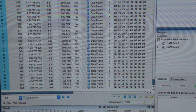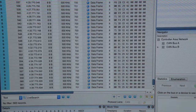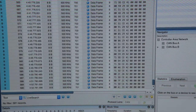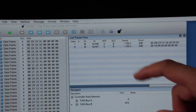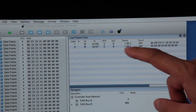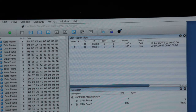This is the CAN bus analyser software. As you can see, the data is coming in. Let's take a look at the packet view. You can see the CAN ID is 700. It has 4 bytes of data. These 4 bytes of data represent the temperature — it is a float converted to 4 bytes.